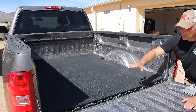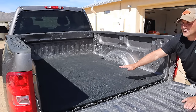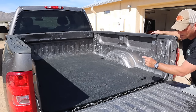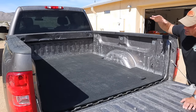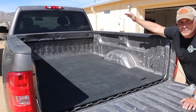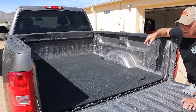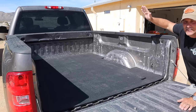I'll first start off with just a simple rectangle frame that will sit on the bed of the truck in between the wheel wells. Then I will build a larger rectangle frame that will sit just above the bed rails. I will connect them just with standard 90 degree angles, and then I will build a slightly narrower and longer frame just under 10 foot that will sit over the cab of the truck. And I will also connect those with just 90 degree legs coming straight down to this main frame. And then at the end, you'll see me start building the sides and doing the angled sections.